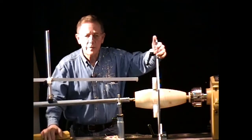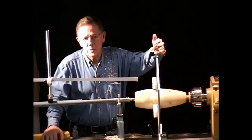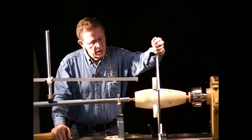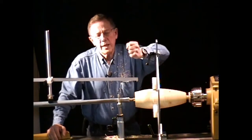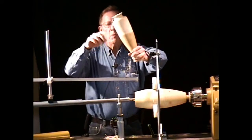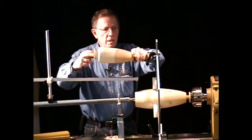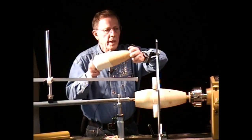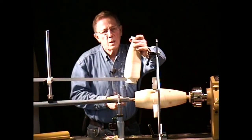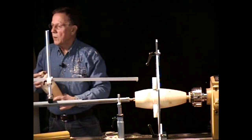You know, I have a devil of a time keeping the humidity down to 60%. This summer, I didn't even get it down to 60% in there with a dehumidifier running practically all the time. So that makes a big difference, and nothing is needed on the end. They're hung upside down, because if they were right side up, or even on their side, the moist air is heavier than dry air. Therefore, the moist air would lay in there and you would get stuff start to grow in there that you don't want to have to deal with. So hanging it upside down lets all the moisture fall out, if you will, and helps it to dry equally all the way through. How green was that wood when you cut it?